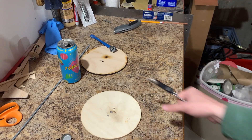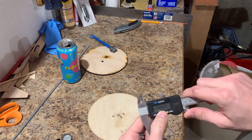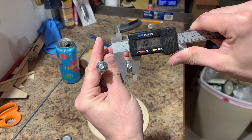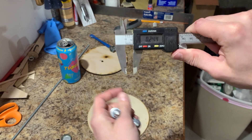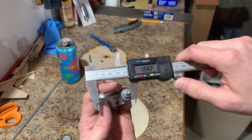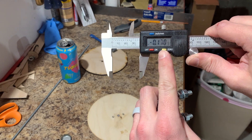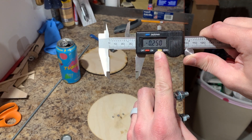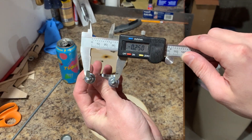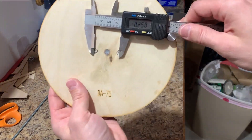Here's a pro tip: I'm laying out my bulkheads and I want to put holes that correspond to these U-bolts. Basically measure the diameter of the U-bolt — it's going to be about 0.24, we'll call it a quarter inch. Take your calipers, measure the outside, zero it, and then go back half the diameter on each side until it reads 0.25. You've measured the outside and you're coming in a half diameter on each side — and there you go, you're right in the center. Go ahead and mark your hole.